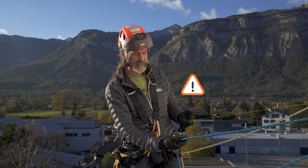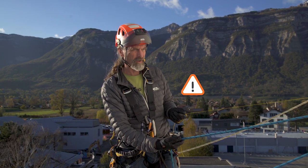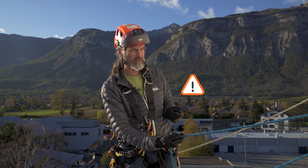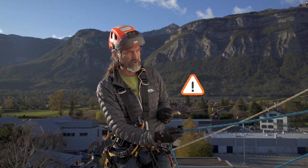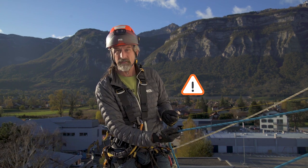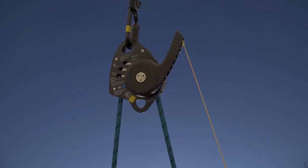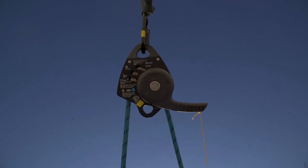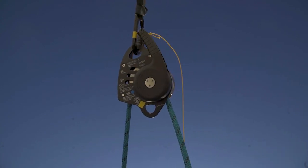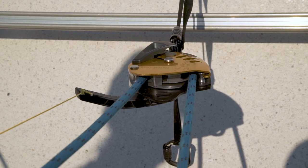If I don't have the controlling rope and the cordillette in the same hand — controlling them separately like I'm demonstrating right now — we have a very significant risk that the movements and lowering will be imprecise, and it could go so far as to lose control of that descent. In any case, the choice of those options is up to you whether you move the operator closer to the edge or not, and finally make sure there's nothing else in your system which could catch on that cordillette and inadvertently operate the handle.